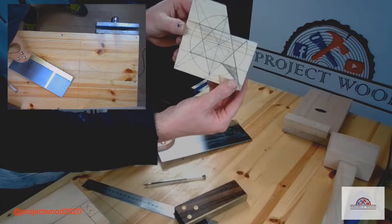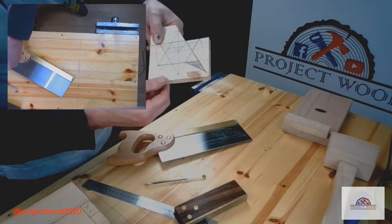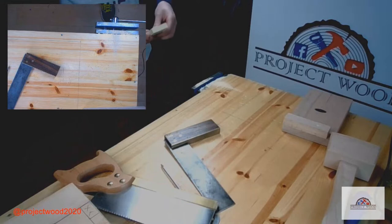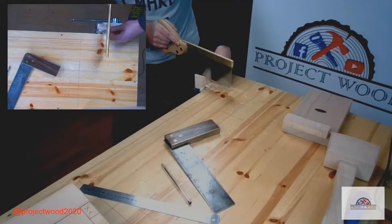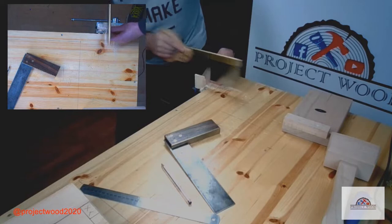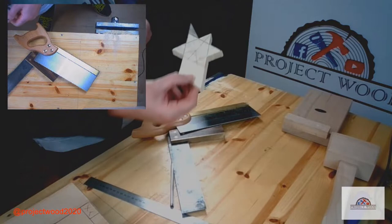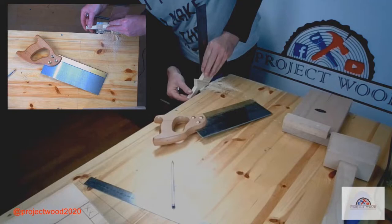Now, as I said, we'll keep sawing and come back at the end. Just be careful here that we take off the extra piece that I showed a few moments ago. Just two more cuts now to do. Now just one more little cut. Again, use your try square just to make sure it is vertical. That will save you no end of problems, especially with sanding later on.